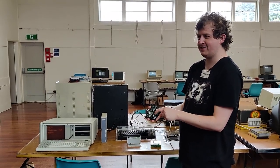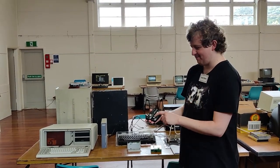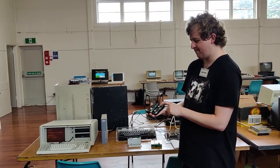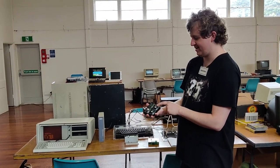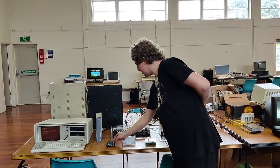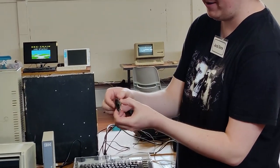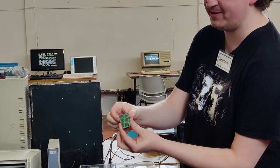And the 6502 you can get from China for $2, and most of the time you don't even get a fake. Whereas the 6510, you have to get a MOS one. They're the only ones who made them, and they're usually $40 plus on eBay and stuff like that. More importantly, the 8501 and stuff, because those die all the time, and they're very uncommon. It will come as a blank board with the surface mount parts on. And you solder the headers in a different spot and the solder jumpers depending on which of the 4 CPUs you want it to be.